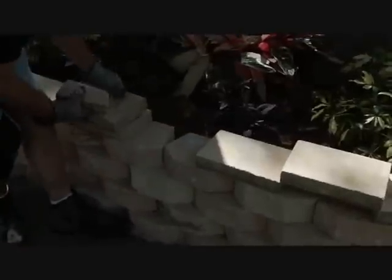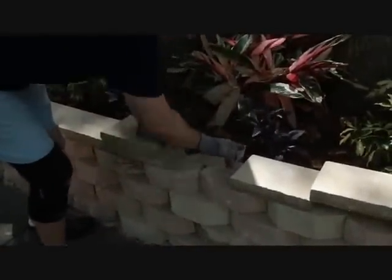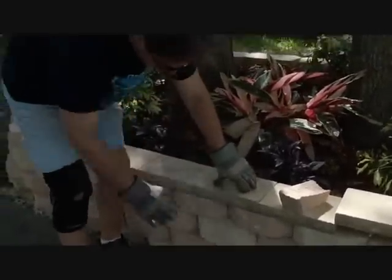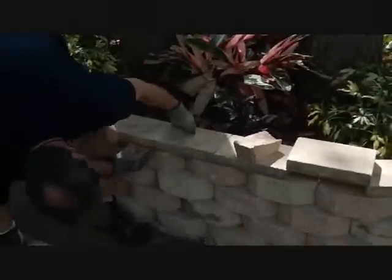This block is a little high, probably due to an uneven spot underneath, and as you can see it wobbles. Because of that, this one's a little high and this one's shallower. What I'm going to do is use that sandpapering method — rubbing it with another block. It'll probably take about five to ten minutes but it'll give me a nice flat surface. Once I get that flat surface it'll be much nicer to lay down without that wobble effect. It only needs about an eighth of an inch removed and that'll make it all nice and flat.